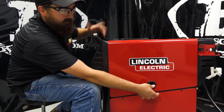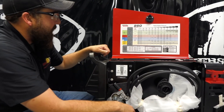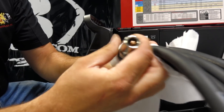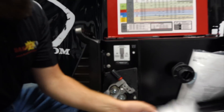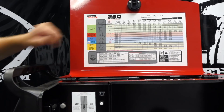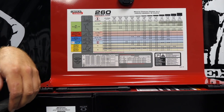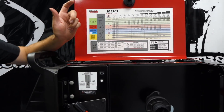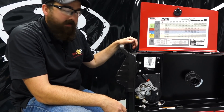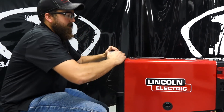On the side here we have the door — different style latch this time. Pretty cool, very nice, very smooth, easy to open. This is how it came right from factory. The MIG gun comes inside wrapped up — it's a new Magnum with the new Linc consumables, as you can see, with their quick-twist tips, all taped up. User manual and drive roll system are in there too. On top you can see the 260 PowerMig logo with all your settings or potential settings listed — what you want to run if you're not running a synergic method.